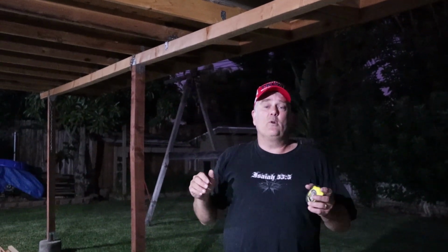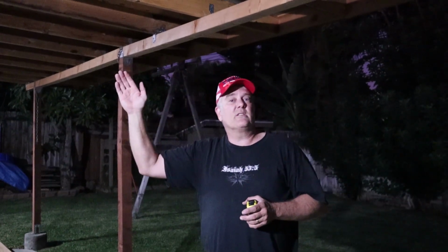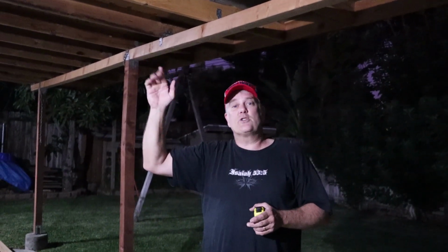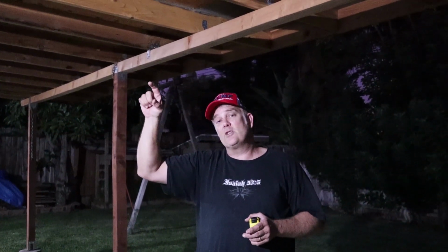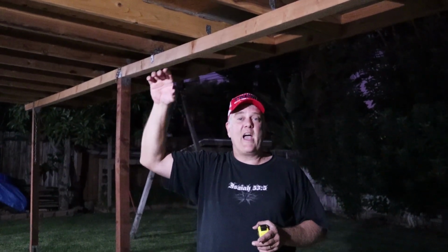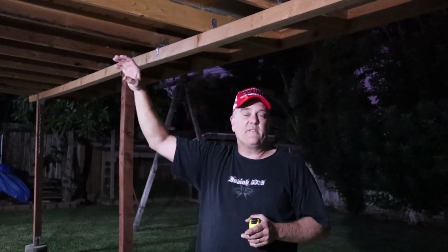A really good example of somebody that just put a video out is Heath from Red Poppy Ranch. He just did his patio cover, and if you watch him, he puts all of his hangers directly on the siding of his newly built house. But he knew exactly where those studs were that he had built himself, so he was able to screw those hangers directly into the studs in his wall, and he didn't have to have another fascia board bolted, screwed to the side of his house.